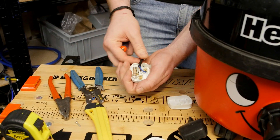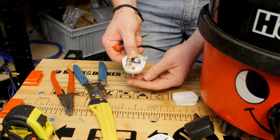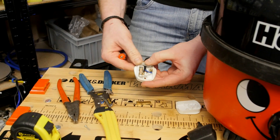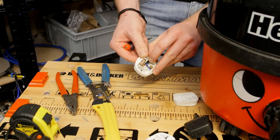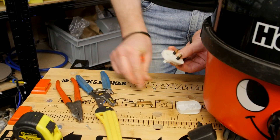With the wires in their relevant clamps, give the cable a tug to make sure it's firmly in place. Then remove the pin because I'm about to turn the plug over. Reposition the plastic mains cable clamp making sure it's pinching some mains cable, then turn the plug over and re-screw in the plastic clamp.